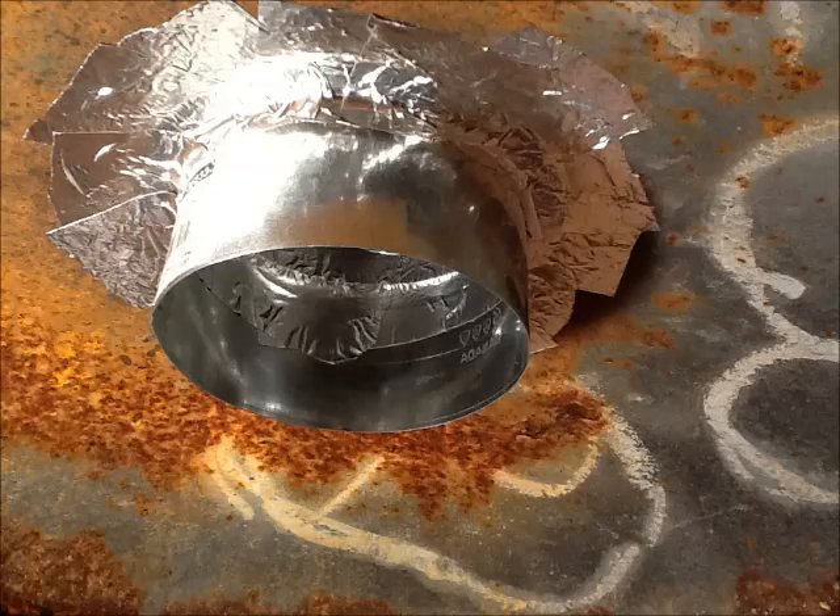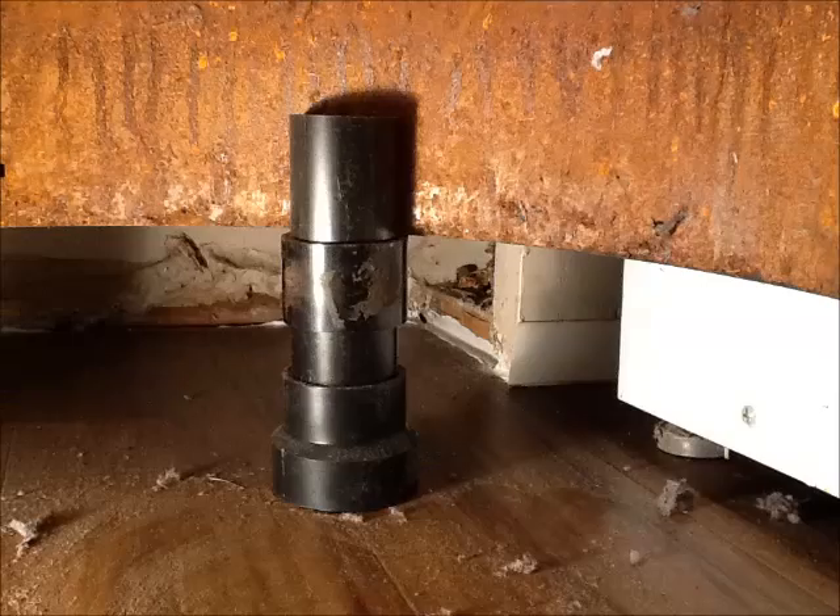After removing the natural gas burner, determine a suitable means of attaching a vent pipe to the bottom of the flue. Make sure this is a watertight connection to help keep the floor dry. You will probably want to elevate the heat recovery tank off the floor for easy access to the lower piping. Remember that a full tank of water is very heavy. This ABS pipe arrangement for the four feet on my tank has a coupling at the bottom with an alignment cut in the upper part of the pipe to support the weight without splitting.